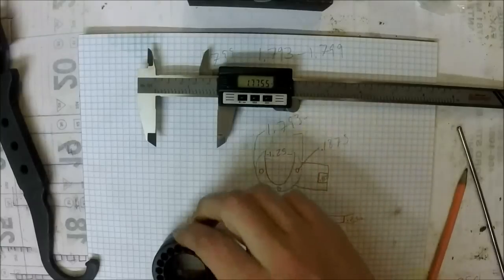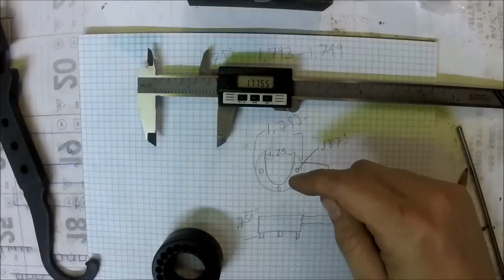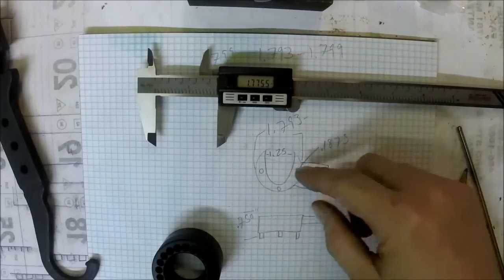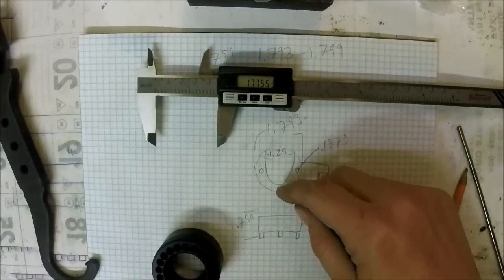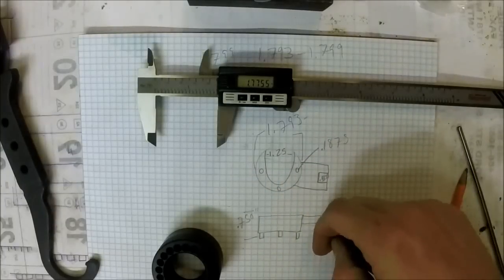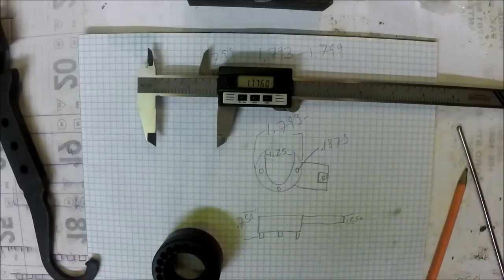So when I finish, I'll machine the outside, I'll put a pass through hole in the part, then I'll part it off and put it in the indexing head, center and offset for the hole pattern, and I'll drill the three holes for the hole pattern. And then it'll just be getting this side piece machined.